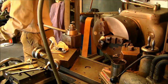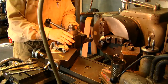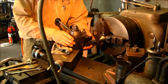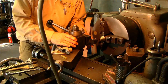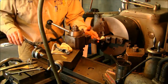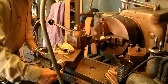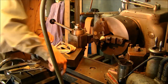Any number of insert cutters or whatever are good. Now you're placing your cutter relative to your path coming in here. You can have as much as you want, but you want to be able to come up to your chuck. I like to still set it almost square, because off of that angle it's going to give a lead angle to the face of the bit. Then you come in here, and before I even get started, I make sure that I can get the whole travel.